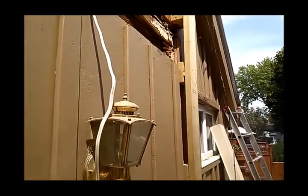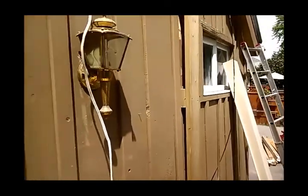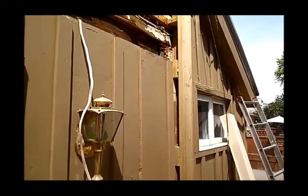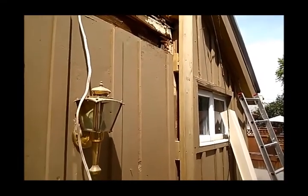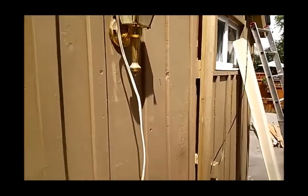You can see that the walls could be anything but plumb. So the solution is to shim out with the 2x6, but you have to remember to include that 2x6 in the size of your deck. But all is not lost. If you had to build out the walls with a 2x6, you can always just add a 2x to the front of your deck.